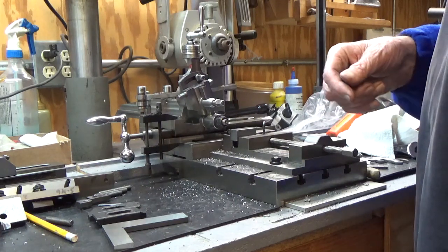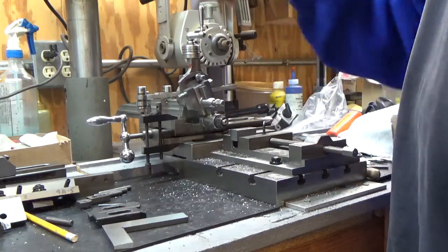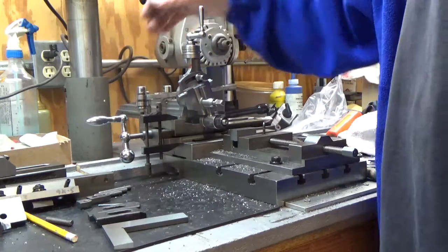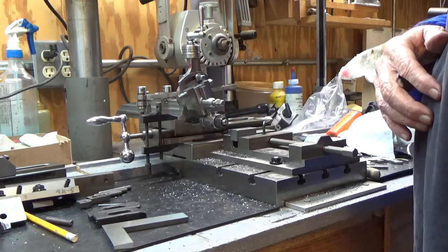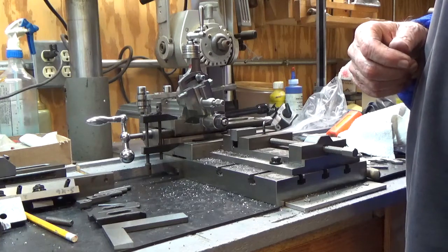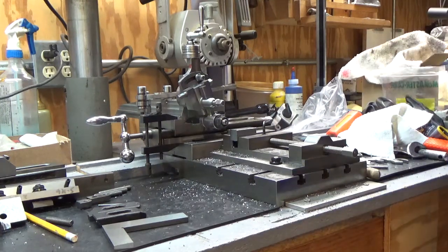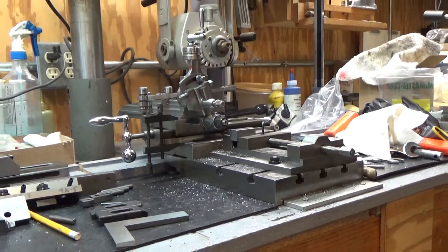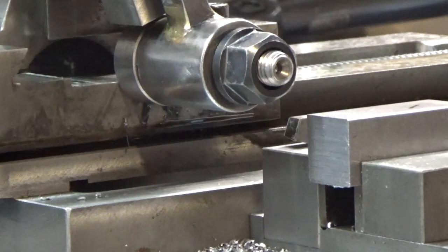I got out the dial indicator today to see how far I'm moving the carriage. I also need to take a little round piece on this side, put it on the rotary table, and mark it out in five or ten degree increments so I can see how far I'm moving the carriage. That's another little project. I just wanted to show you what's going on with the shaper - I've got one more tool bit sort of figured out, and hopefully I'm going to keep working on tool bits. Anyway, just a short video - thanks for watching, bye bye.